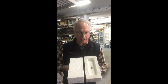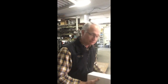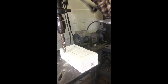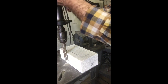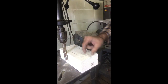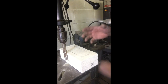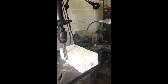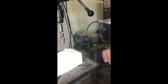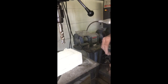I've cut the top already and now I want to cut the bottom to mate with it. I'm using a standard masonry bit — in this case a three-quarter inch — and I'm setting the limiter on my drill press to the depth I want so I never cut any further. I want to keep at least an inch of material around the hole I'm creating for the bronze in all directions — that is essentially the size of your crucible. I'm going to drill a series of holes down the length of the brick to eliminate a lot of the volume. Be careful not to exert too much downforce as you drill or you'll crack the brick.